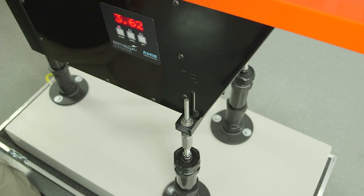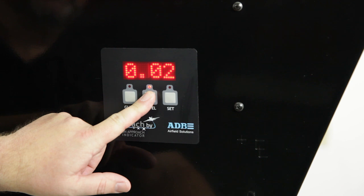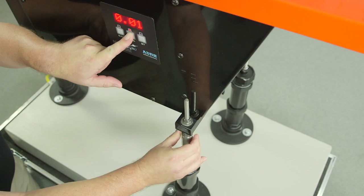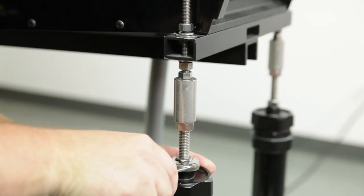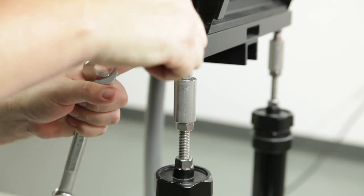Adjust the horizontal level, and then set the vertical angle. On the display, press the level push button to display the azimuth or horizontal angle. Adjust the right front leg for zero degrees to make it perfectly level. Then set and block the right front leg. This step may take multiple attempts to accomplish.